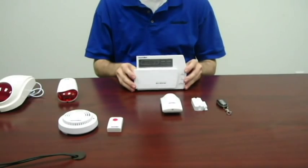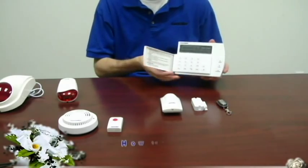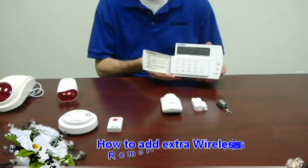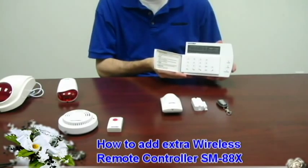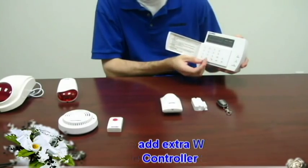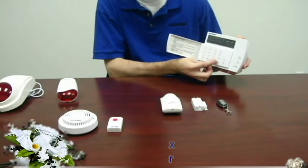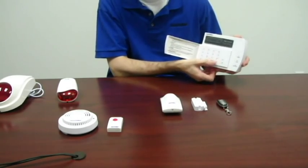To add additional sensors into your Air-Alarm1 system is quite simple. Please be certain your Air-Alarm1 host keypad is disarmed. You may then access the settings with your 3-digit personal password or the system default password, which is 888. Begin by pressing Set, Password, 888, Enter. The code to add would be 70, Enter.